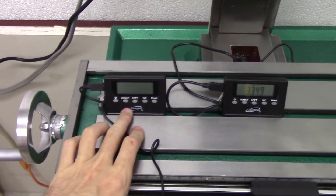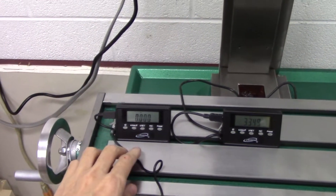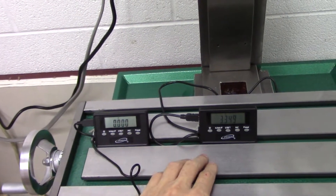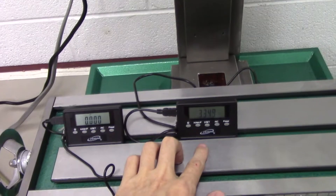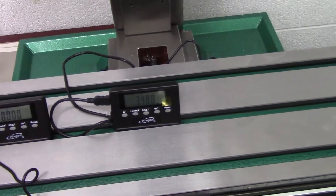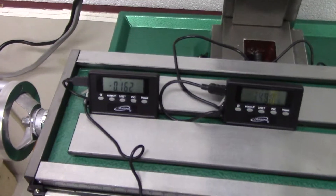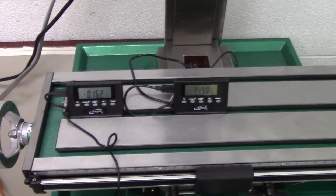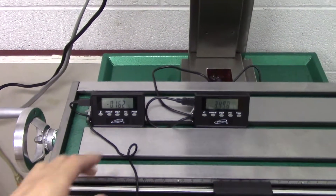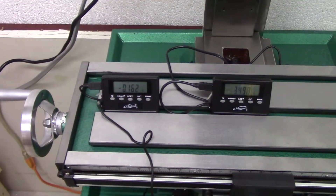Okay, these are the readouts. One is on, one is off — let's turn this one on. As you can see, it does remember the last number where you were at when you turn it back on. The right one is for the X axis — as you can see the numbers changing. The left one is for the Y axis — as you can see the numbers changing there. The increments are thousandths of an inch and it even reads half thousandths. There's a little tiny five right there — it does read half.